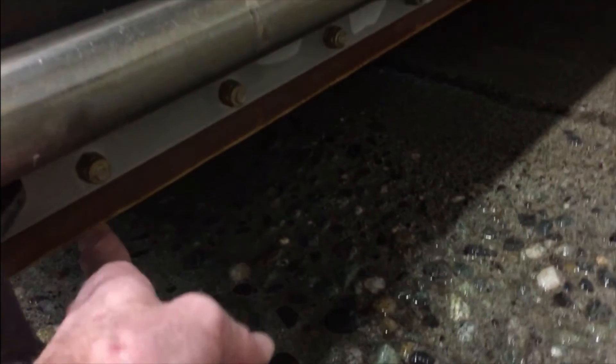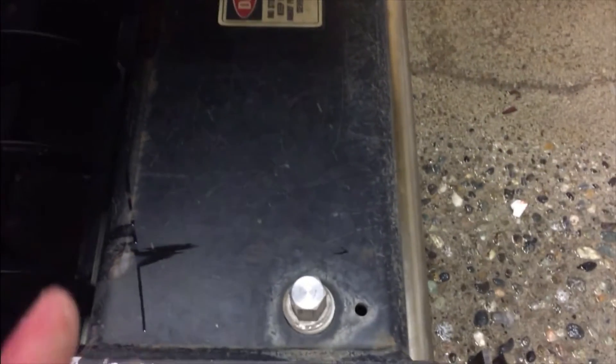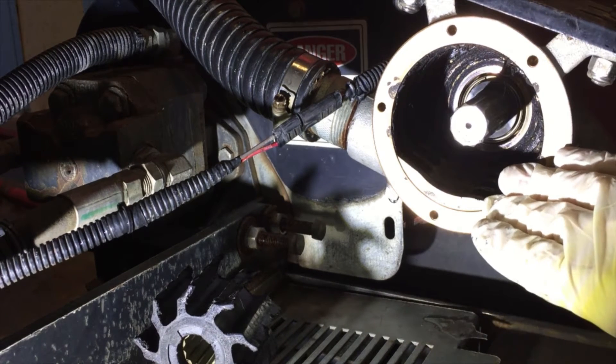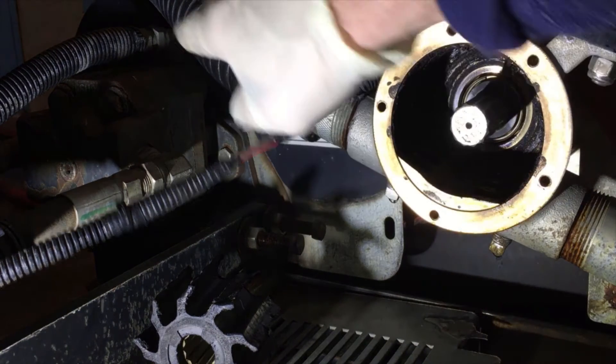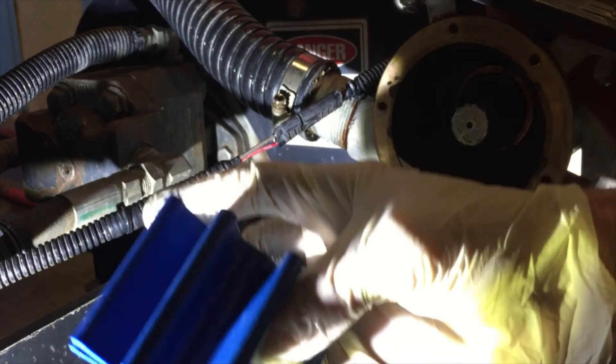This is the port where we fill the wash water — don't get it confused with the exhaust. As you saw in the diagram, the wash water system operates between the squeegee and the blade. The water is jetted towards the center rinsing the ice off, then the wash water pump with the suction hose and the check valve sucks the water up into the pump. That's how the wash water system works — this is the pump that sucks the water back up into the tank.